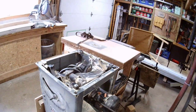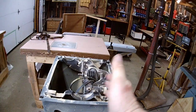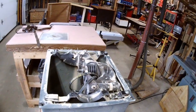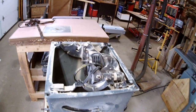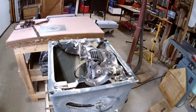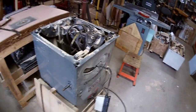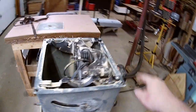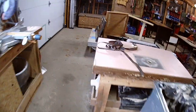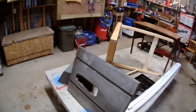So I said I'm going to have to take the top off the table. I didn't want to do that because it messes up the alignment for right-angle cuts. I'm going to have to do a complete realignment and setup of the saw. It turns out the tabletop has just four bolts holding it on, one in each corner.